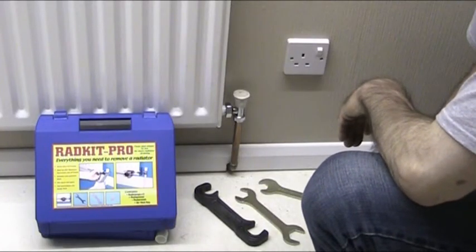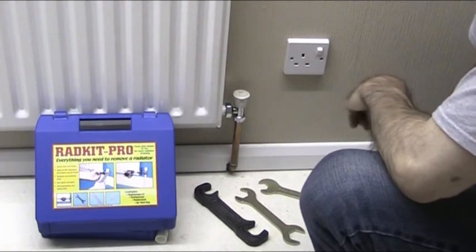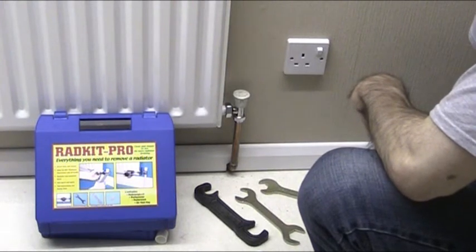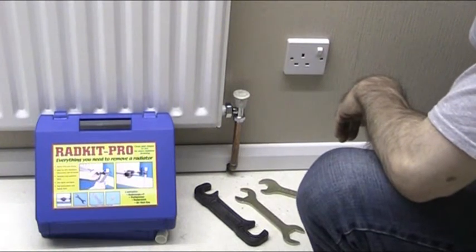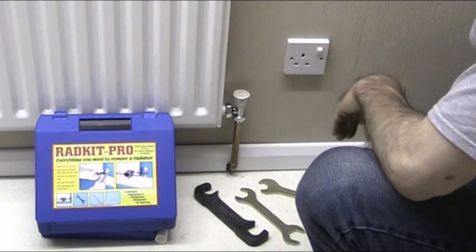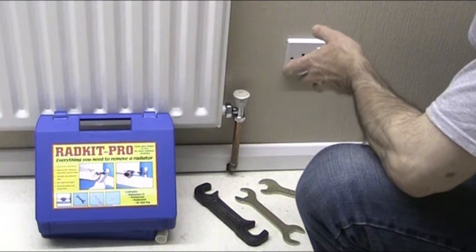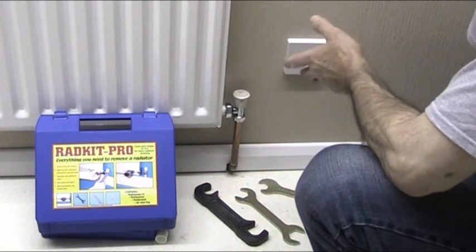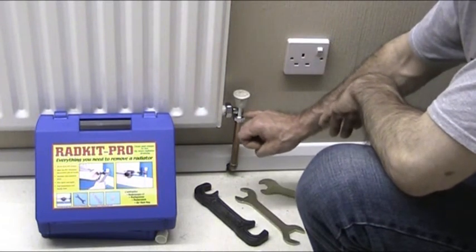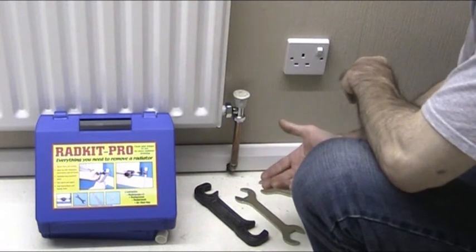What we're going to discuss in this video today is how to fit a convenient drain off point to your central heating system. I used to find that when I did any repair work on an existing heating system, we could never find the drain off. It was usually fitted under the floorboards or somewhere where you couldn't find it, which was pretty pointless. You do need to fit the drain off point at the lowest point in the system, but you also need to be able to get at it. I'm going to fit a drain off point on one of your radiators, which is above floor level but at a low and convenient point.